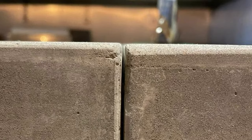Tip number 3, make sure that all your mold materials are cut accurately. There's nothing worse than, and believe me, we've done it, where you get to the end of a project and you install some concrete worktops, for example, and the lip on one piece is that big and the lip on the other piece is just a teensy-weensy bit smaller. It absolutely sticks out and it will bug you forever. So make sure that you cut them accurately.